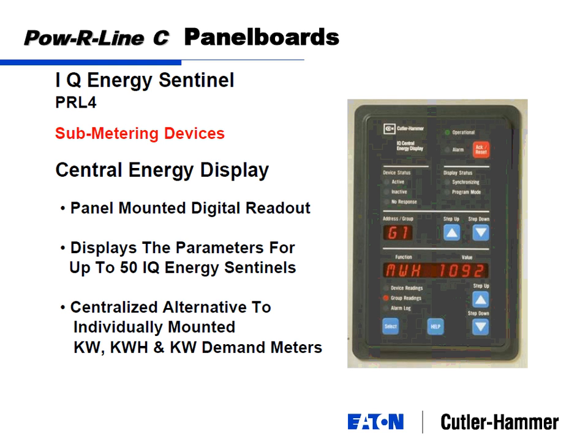So when it hits the site, you're looking at a meter on the front of your equipment, and then you'll open that. Maybe there'll be a hinged door behind there, and in behind the meter, in the hinged door, will be all the factory wiring, all set. So there shouldn't be anything to do other than maybe turn the PTs, close the disconnect on your voltage source.